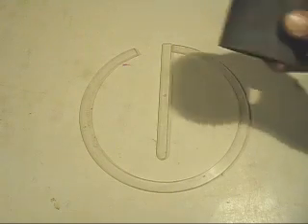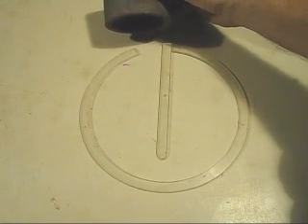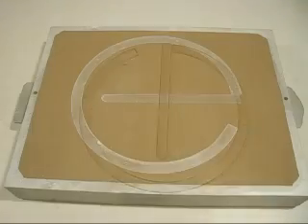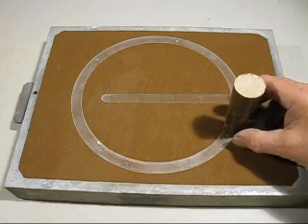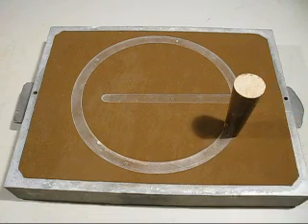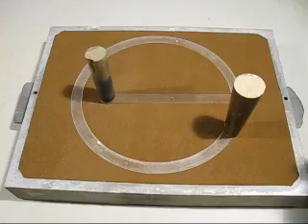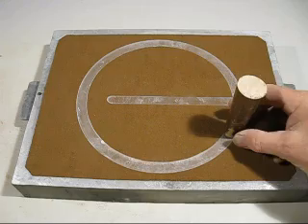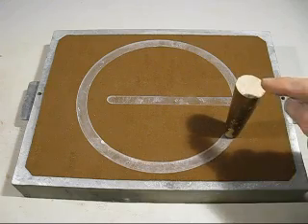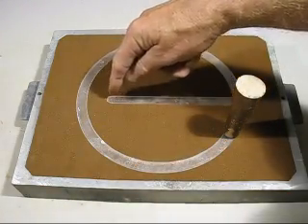In the third experiment I'll be using a riser to give a bit of head pressure on the mould. We've got one half of the mould rammed up. This is the sprue where the metal comes in and this is a vent so the air can flow out of the mould. The second test mould has a sprue and we'll see how far the metal flows without a vent.